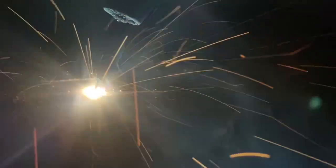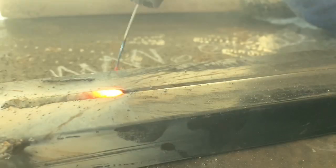I'm trying to run this one as far as possible, so I'm going to exaggerate my stick out maybe by an inch or two — about an inch right here, maybe two to two and a half inches. Let's see what happens when you use too much stick out. Stay tuned to see the results.